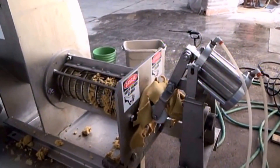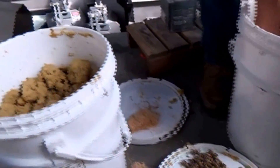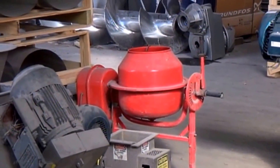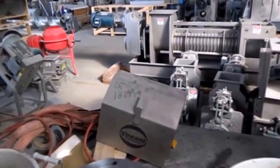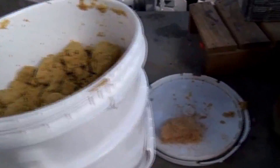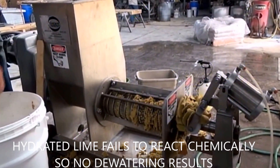As predicted, a complete failure. We were going to take this material and blend a press aid with it. But if it had been soupy decanter sludge, we could have done that pretty easily — we've got a cement mixer right over here where we routinely blend press aids into samples that need them, like apples. If you put apples in the press, you'll get applesauce through the screen; blend some press aids with the apples and you'll get apple juice through the screen. This stuff — there's no blending. It would be murder impossible to blend these fibers into this material. That's why we can't do the test we promised of running this with the press aid blended in.